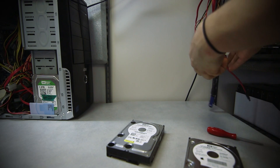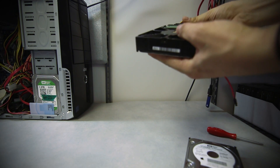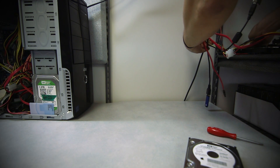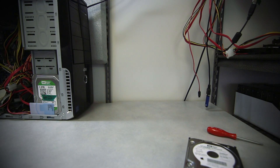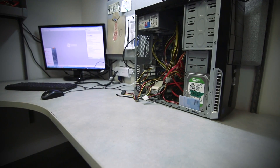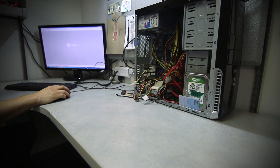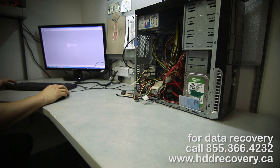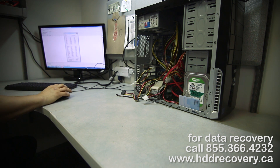It's available on channel zero right here. I'm going to run express test on this drive since we have it hooked up to channel zero. The drive powers on, spins up, calibrates, and comes up ready normally. If we go in and test it, the family that it identifies is Tornado 2D, and this problem was really common along a lot of Tornado drives.